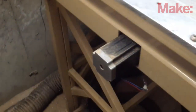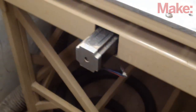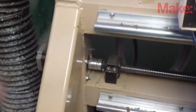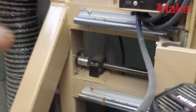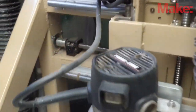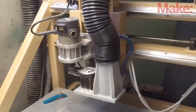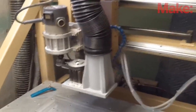This is what's called a stepper motor. It spins, but it spins as a series of steps — in my case, 3200 steps per revolution. You can see I've got one on X, Y, and Z. X is tucked around there — you can see a little coupler and then the screw. A given number of steps equals a given amount of travel, and the software that runs this machine knows how many steps equals how much travel. That's how it knows basically where it is.